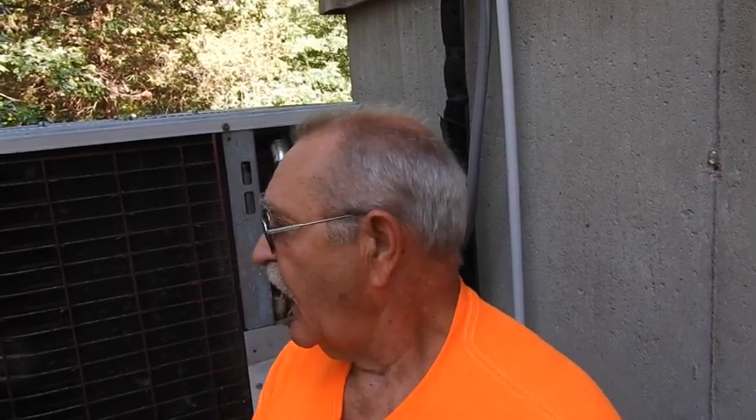I've got good news and bad news. The good news is the thermostat is apparently at fault. The bad news is I don't have a heat pump thermostat in stock — this is a heat pump. There's apparently some damage done by that corrosion on the circuit board. The only way I can get the air conditioner and blower to shut off is by physically removing the thermostat from the sub-base. Turning it to any position at all, it continues to run the air conditioning. So I'm going to go ahead and change that thermostat — got to make a quick run to the local supply house.